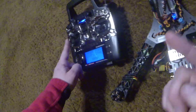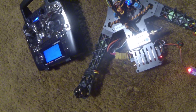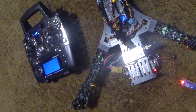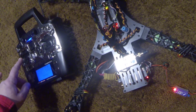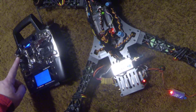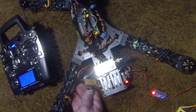We plug it in again, so now we have our full throttle command. Once we plug our battery in with that full throttle command present, it puts the ESCs into programming mode. From there you can program them as normal. Hope it helped — if it did, give me a thumbs up. See you later!